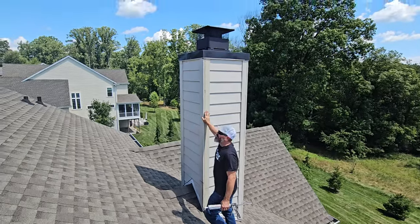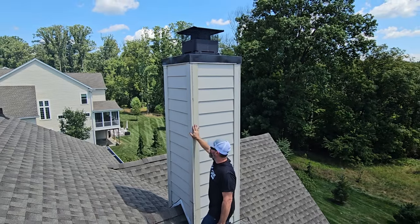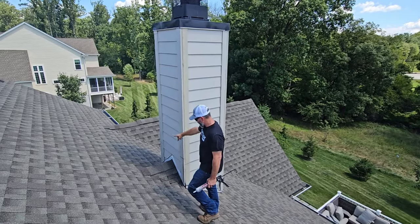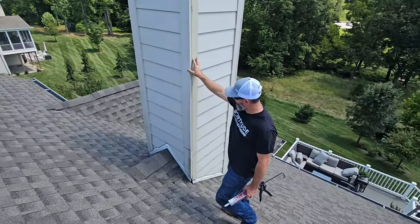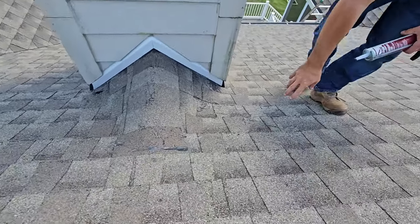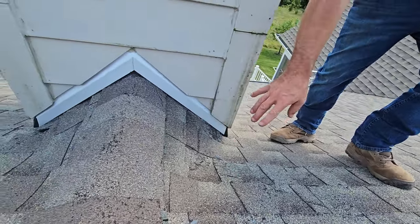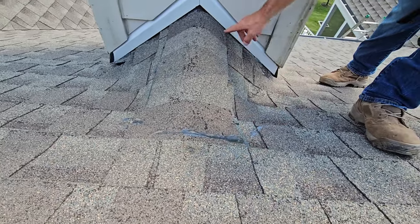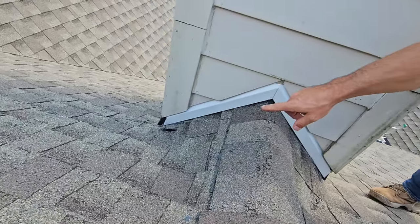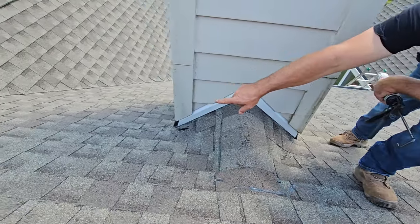Look at this chimney — look at it moving. This is a brand new build and the builders came to re-secure it. The whole thing was leaking and moving all over the place, breaking all the flashings around it. They had the framers come and re-secure this, which they didn't do properly, and then had the roofers come in and fix it. That looks horrific — they reused old shingles that have marks all in them, there's exposed flashing, caulking all over the place, a cracked ridge cap just stuck in with caulking. The shingles are buckled and marked — it's going to leak.